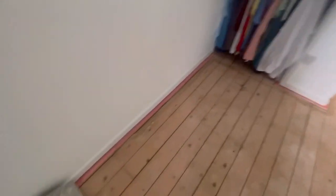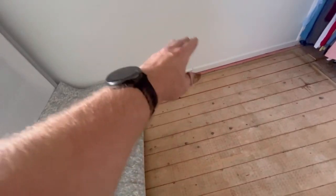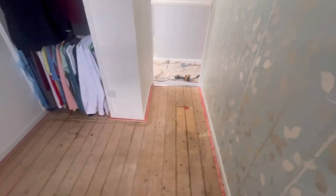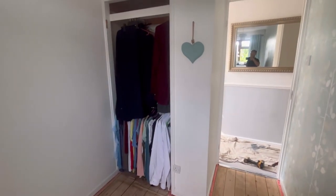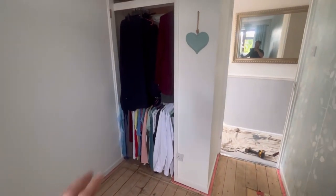Got the bed and carpet out of the way. It's really creaky — I'll turn a few boards up. What I normally do is get the boards up. They've already been up for a reason, so I'm hoping we can find the pipe. There's a radiator in the bathroom somewhere here, so I'm hoping to find the drop to the bathroom — that'll give me a good idea of where I need to come down from. I'm hoping to pick the manifolds up somewhere in there, but I'm guessing the cylinder used to be there and they've upgraded to a combi, which is down in the garage.